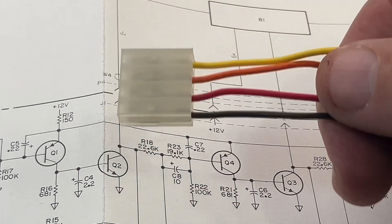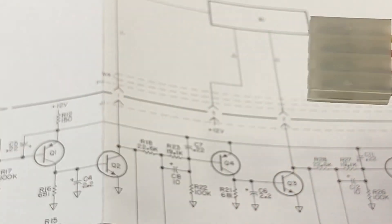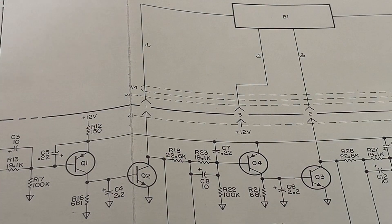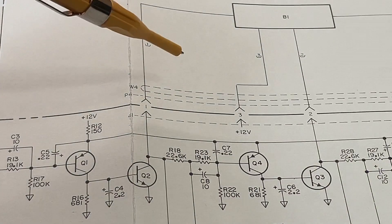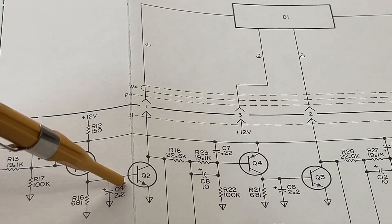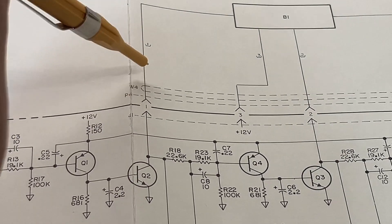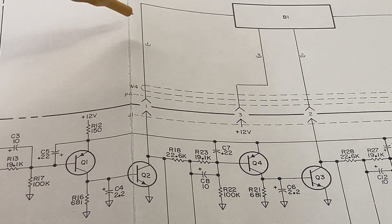I wanted to reuse the four-pin Molex connector with the new fan, but of course we'll only need two wires: one for 12 volts and one for ground. Looking at the schematic: 12 volts comes in through the orange wire, so I'll use the orange wire for +12V. I decided I could use the brown wire (pin 1) as ground if I remove Q2 from the circuit board and place a jumper from its collector to its emitter — that will ground pin 1. So: orange wire for +12V, brown wire for ground, supplying continuous power whenever the instrument is on.